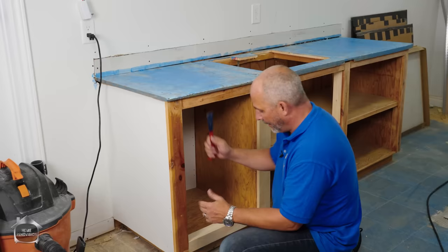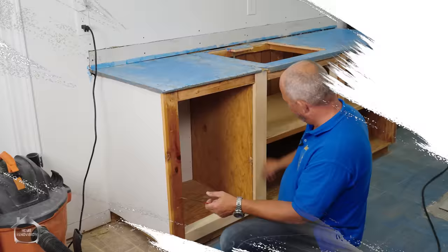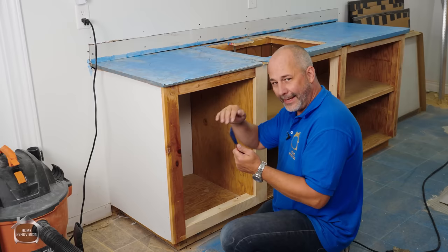Whenever you're repurposing old wood, remember it's basically soft wood, so it's got a lot of flexibility. You want to sand the old and the new — soften up all the edges, even on the new wood. This is just to create some consistency. Generally it comes milled with a sharper edge, but when you're sanding something down, you can get rid of all the dings and imperfections that have happened over time. Mold your old with your new.